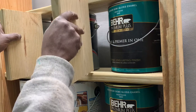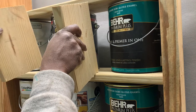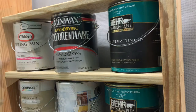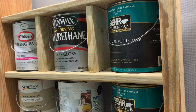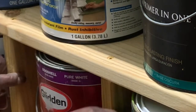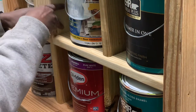I had made some cuts for spacers to go in here, but they're a little too long, so I'm just going to have to shave a little bit off. Then we'll place them in there — from the top I can screw it in, and for the bottom I'll get under there with my drill. If not, I'll just toenail them in. Now that I've got my height I can go ahead and set up a stop block and make these cuts.